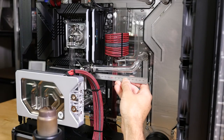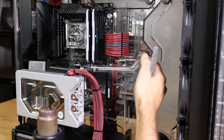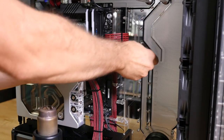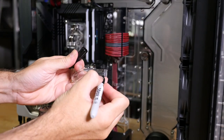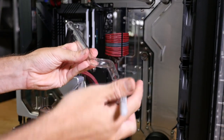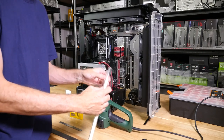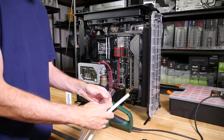You can see that the offset on this tube is not quite big enough — this is roughly horizontal here, and the offset needs to be about 10mm longer. So I'm going to have to make this tube again. It's also not quite long enough on this length here. Often what I do, because I'm doing a whole lot of them at once, is just put an arrow there with a note — 5mm — and then another arrow with plus 10. This time I come back to this tube, use it as a template, and I know I need a little bit more here — probably 5mm — but I'm going to give it a lot more.